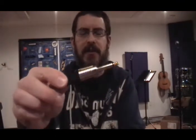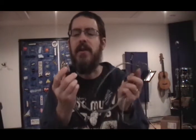It's got a stereo 1/8-inch stereo TRS plug on one end, and on the other end it has a mono 1/4-inch TS plug. It actually has some passive resistors soldered into the plug, because a lot of cables you'll see on the market have these same connectors but instead of using the passive resistors, those cables will simply short together the tip and the ring — the T and R in TRS.